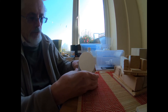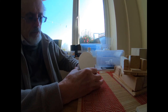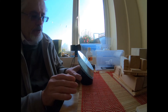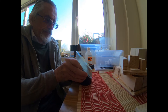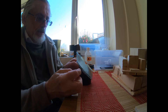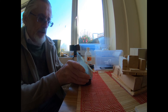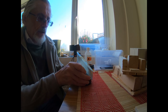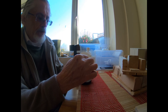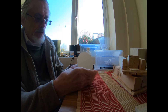With this system, the magnets are holding it and you can move it around in position as much as you like. It can also tilt up and down. So you put it in position, the magnets keep it nice and snug, all the safety mechanisms stop anything dropping off, and then you can adjust and position it. I use a bit of paper on here with the sweet spot marked where the centre should be, and a laser collimator, and then it's quite a simple task of lining everything up and getting the offset absolutely right.